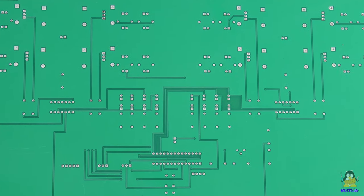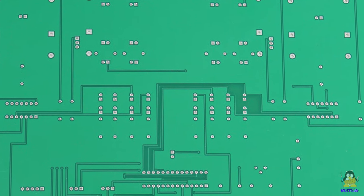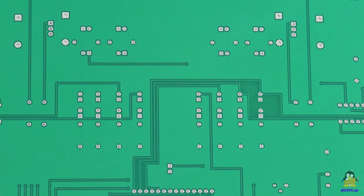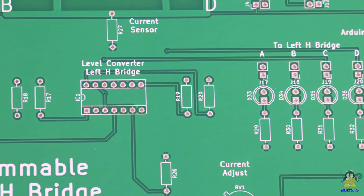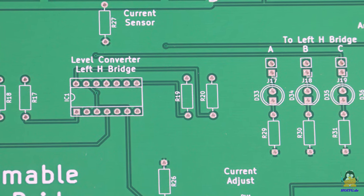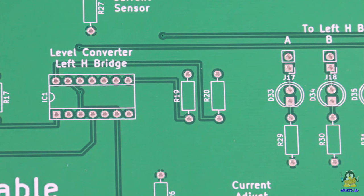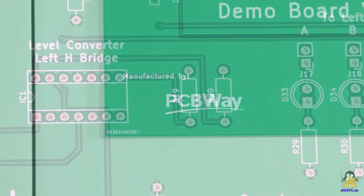On the PCB, the conductive copper tracks are covered with an insulating layer of plastic film, which minimizes the risk of accidentally shorting traces. All components are labeled and can therefore be referenced more easily. The possibility of having any lettering or graphics printed on the surface makes the circuit board widely self-explanatory.